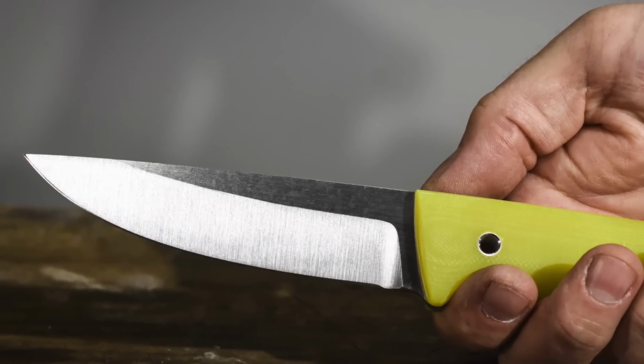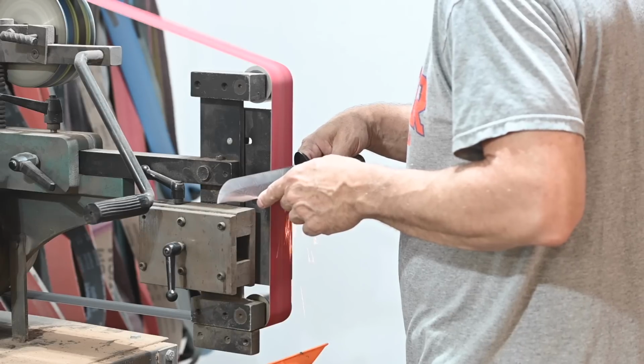All right, so what I'm going to do today is talk generally about using various measurements to get good bevels. First, let's talk about what makes a good bevel, and then I'll circle back to Brandon's question in more specifics. So basically, job one, you want a knife to cut well and to be strong. Now, sadly, strength is almost always the enemy of cutting ability. Sorry, just is. So you're always having to balance those two qualities, hopefully optimizing for the materials and intended uses of your knife. Camp knives and choppers are way over here, paring knives and scalpels are over here, and everything else is in between.